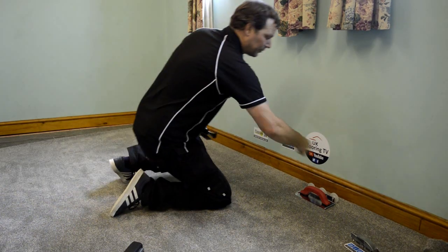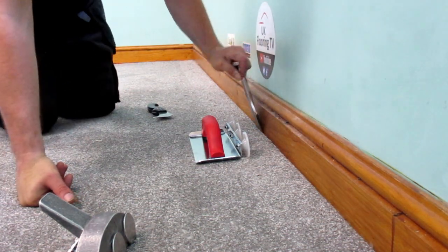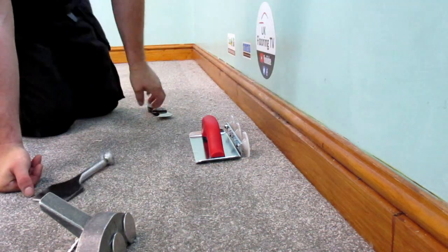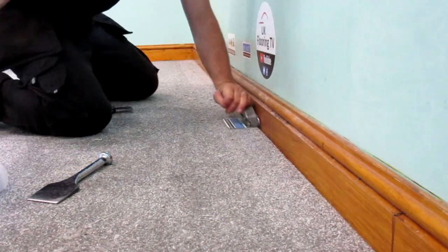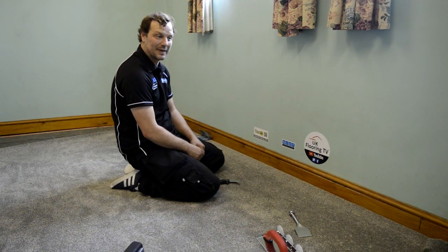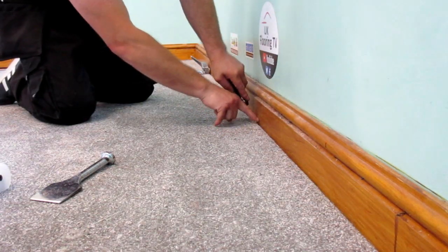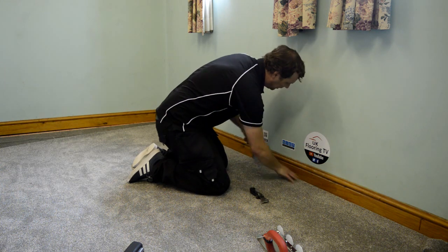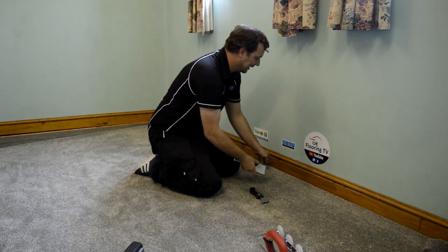You saw how easily we went along the wall with that. Some people use this — and you get some nice marks on the skirting with it. You can pop it in with that, but the amount of time these things take — you're talking a whole wall in a couple of minutes with the rolling tucker. When you're using something like a stair tool, you are going up and down and you need to be careful you're not putting little marks. Also if you've got a little burr on it, it'll mark the walls. These rolling tools are pretty safe.